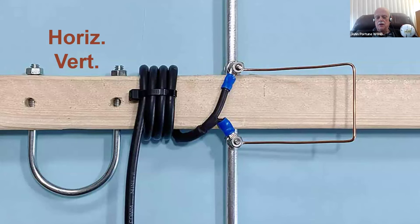that I have on my 2 meter version of the Yagi. You can see it. How did I determine the size of that, which is 2 by 3 inches, by the way? I just did it by simple ham pragmatism. I figured it's going to be 2 inches wide, because that's how far apart the screws are in the driven element. That's the driven element with the aluminum foil on it to make it conductive. And by the way, there's a gap. You can't see the gap because it's inside the wooden boom.